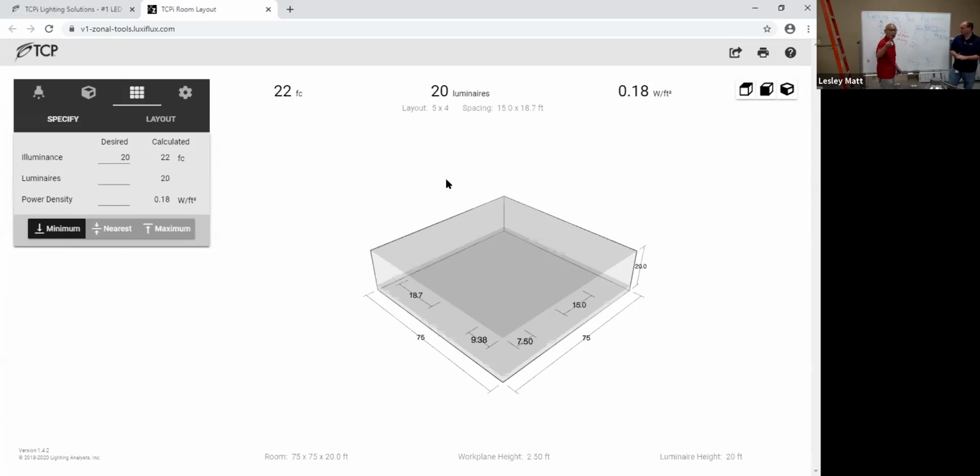Then I'm using 20 times 250. Am I right? So I have 5,000. So actually, 20 of those 250-watt metal halides over there use about 5,000 watts. That's a lot of watts. Now you're using 50. 50 times 20, you're only using 1,000 watts now. That's what we call 80% savings over there. That's a big savings.